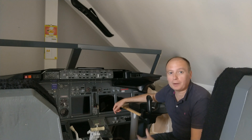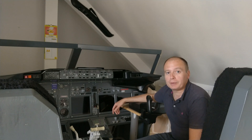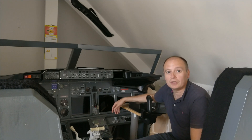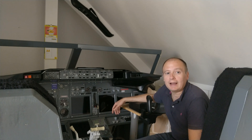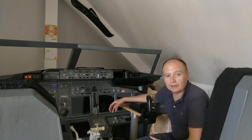Hello everyone, welcome back to the channel. As you can see the front windows are back painted. I must say I did expect this covering job to be much more difficult than it was. Yes it was a slow job because there was a lot of cutting and testing until each part fitted, but at least it did not drive me completely insane trying to calculate all the angles. The work itself isn't 100% precise, nor is it a hundred percent a replica of the 737, but that was never my intention. To paint the windows I used MDF ground paint with a spray gun — just one coat — and then two coats of usual Boeing gray paint done by hand with a roller.